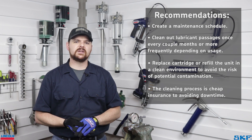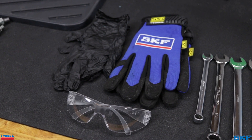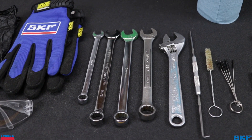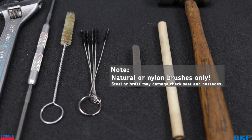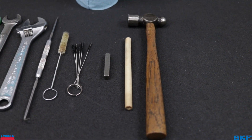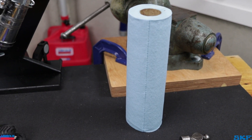This is a simple process that should take a few minutes and get you back in service. Some items to have on hand are: first and foremost, safety equipment such as eye protection and gloves; wrenches; cleaning brushes — spray gun brushes work really well when cleaning the gun head passages; a magnet to remove the check ball; a dowel and hammer for reseating the check ball; and plenty of shop towels or rags.